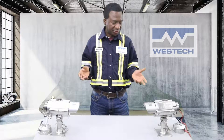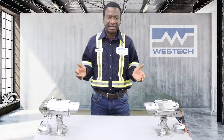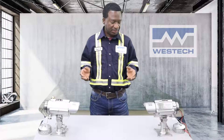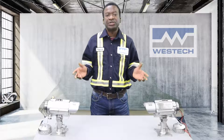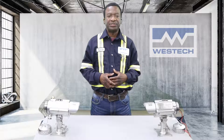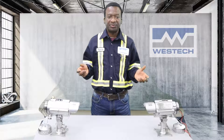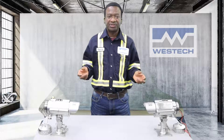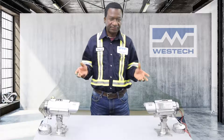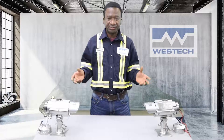When there is gas present, the tricolor LED will flash red to indicate a low alarm level concentration of gas. When the LED is solid red, this indicates that a full alarm condition has been established. If the current output milliamp goes to 21, the status LED will remain constant at red and the current output would be 21 milliamps. In a situation where a 1 milliamp signal is seen back at the PLC, this is an indication that there is a critical failure of the electronics. It is also important to note that when zeroing is being done after installation and alignment, the device itself outputs a 1 milliamp signal to indicate that the zero is being performed.